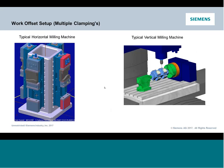And you're not limited to just being able to do this on a horizontal. So if you got a vertical machine like we were just talking about, and you want to set up a fixture where you can handle multiple parts, and whether it's just 0 and 180 or maybe 3 or 4 sides, this process you're about to see can be applied to a vertical machine the same way it works on a horizontal. It's just certainly much more common in a horizontal kinematic or horizontal setup.